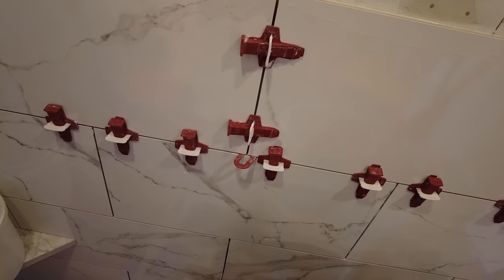If this was a marble tile or a natural stone tile, which is soft compared to porcelain, very soft, then the sand on these wedges would definitely scratch that marble. So in that case, you would want to definitely use some kind of protection plate. These protection plates are the ones made for this system, but you can get generic ones. So I'll put a link in the description for the generic ones, and you can use those for any type of wedge system.